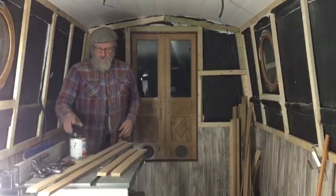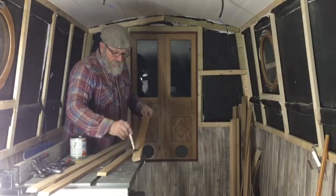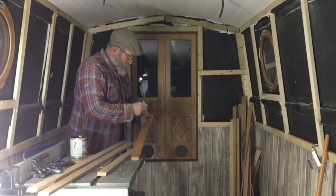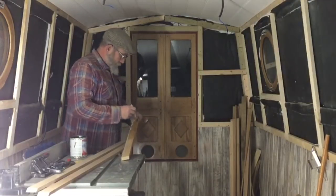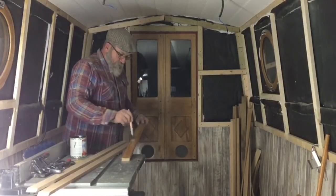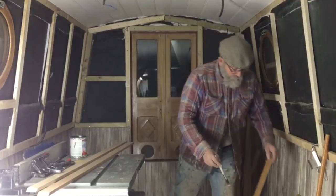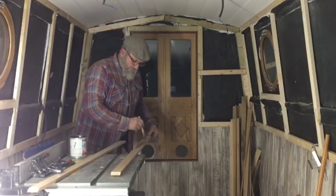Well, hello there. I did get a little second wind, and I did actually get cleared up. Then I also remembered that I wanted to get a first coat of varnish on these four pieces here. These are the door lining to go around, so I thought I'll get one on there before I call it quits for the night. I've got the centerpiece on the door as well, the center strip, and I've given the doors a bit of a touch up where I had to machine them out to fit into the metal frames, but they've all got slightly scratched where I've been working, so they've all got to be flatted off. They've had five coats on there, so they're quite well protected, but I'll flat them all back with some wet and dry later on down the road.